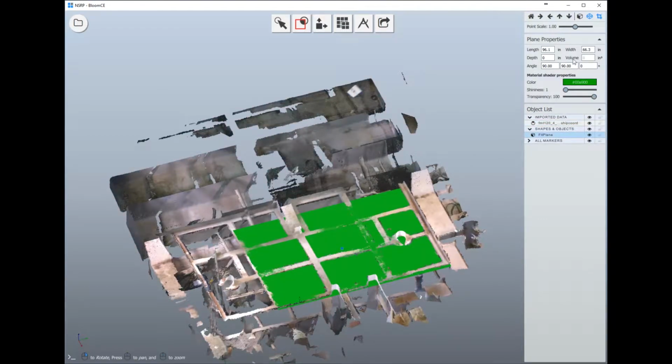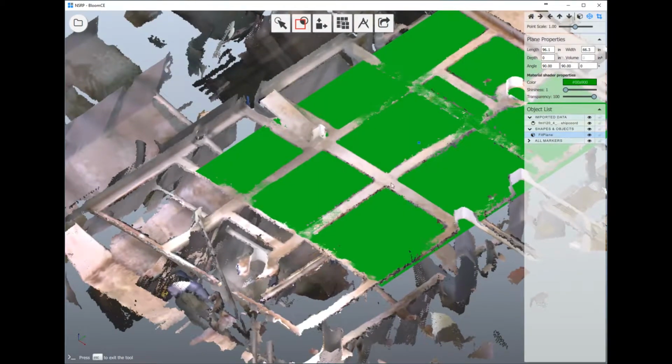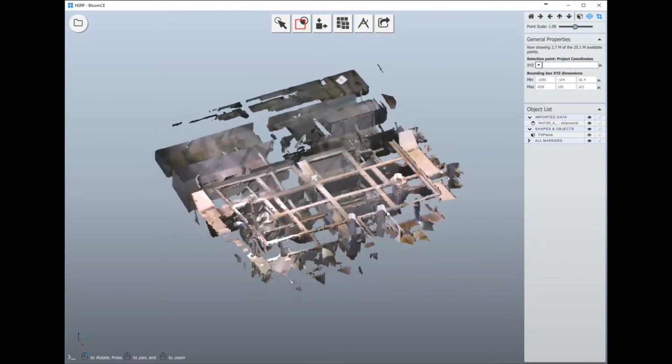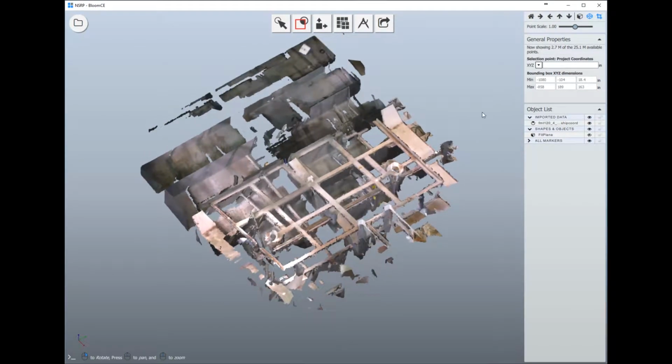The reason I used this plane was because it has a very good quality surface normal. So if we look at our plane, where it did have a 2-degree rotation before, now it's nulled out and it's completely aligned to the coordinate system. If we look from the side view, that plane will essentially disappear because it's completely lined up on the XY plane in our coordinate system. So we don't need that plane anymore. We've got the data lined up.